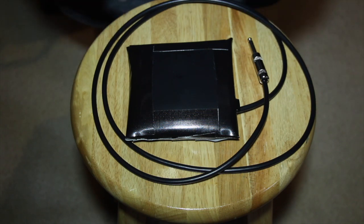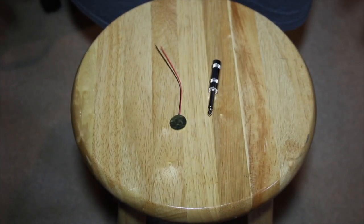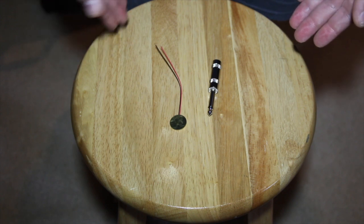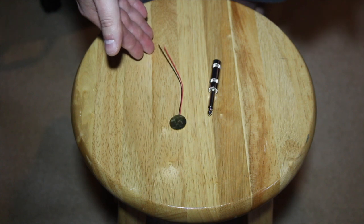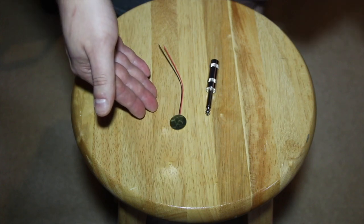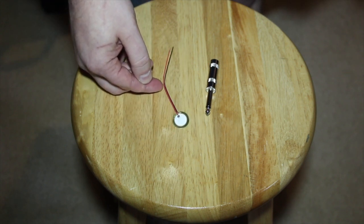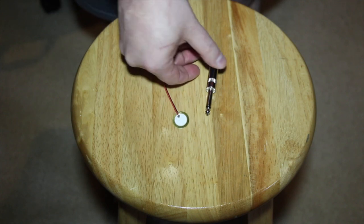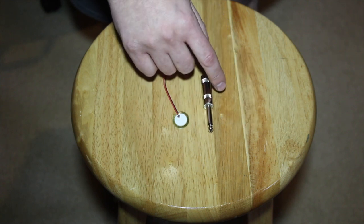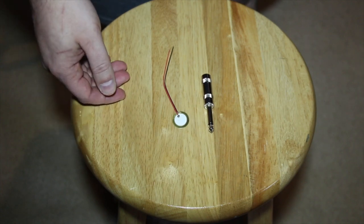After this, you should be able to do something quite similar. Let's go ahead and show you what the materials are and basically how I built this. As far as the electronic components are concerned, these are about the only things you're going to need, other than some instrument cable to hook everything up afterwards — that will go from the end of this piezo element, which you can get quite cheaply from any electronics distributor online, like Mouser or Digikey. You can also find them on eBay pretty cheaply, and a lot of them will come with some leads already attached. You're also going to need some kind of plug at the end to plug it into whatever you're going to use, whether it's your interface for your computer, or a drum brain for an electronic drum set. It just depends on how you plan on using the drum trigger afterwards.